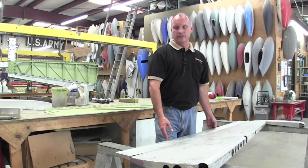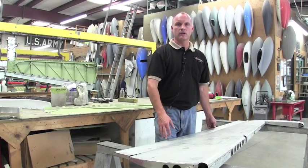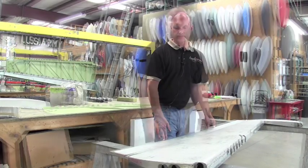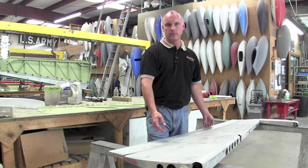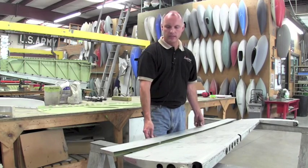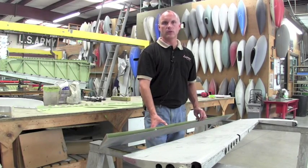The original style of trailing edge segment had a foam core which tended to hold water and moisture, which would in turn cause corrosion of the trailing edge segment. The proper way to address this corrosion issue is to remove the old style foam-filled trailing edge segment and replace it with a new style trailing edge that does not have the foam core.